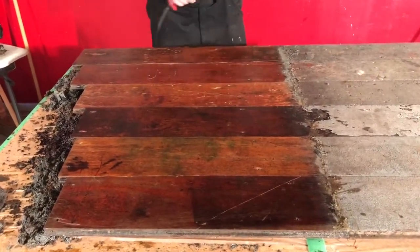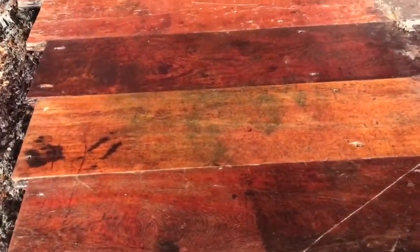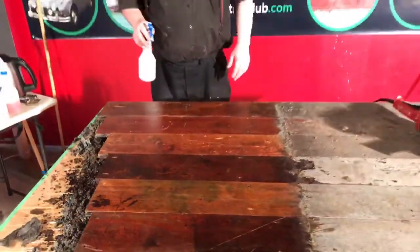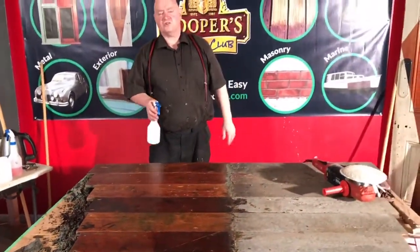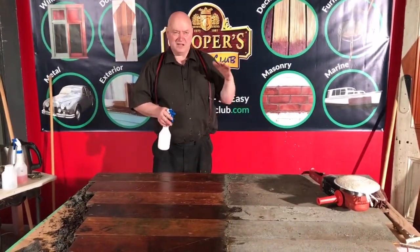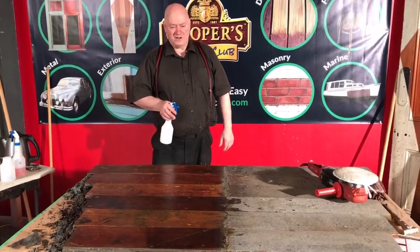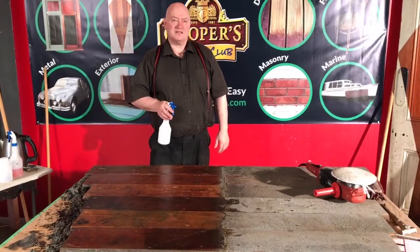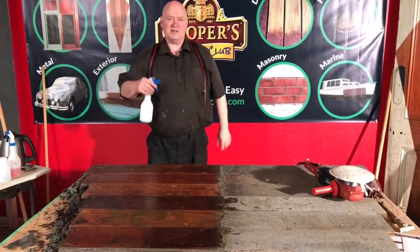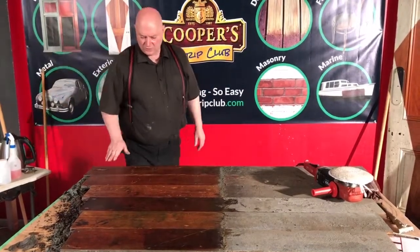Okay, so that's that. And again, you just keep an eye on it. For the first few days, it's just going to drink and drink and drink until it won't drink anymore. But if you put on thick moisturizer with the brush, it becomes a real mammoth buffing job, and you find you're walking it around with your socks and things. It's better to put on small amounts and let the floor acclimatize to it. And it then becomes a really easy floor to look after.